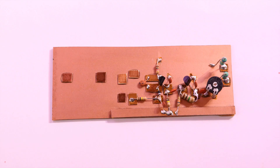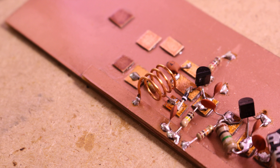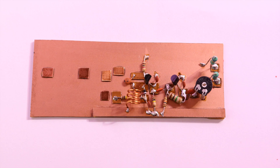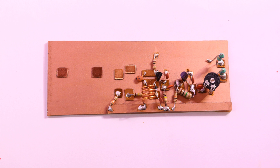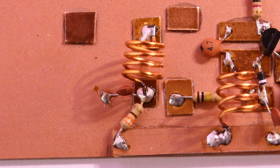From the varicap to the pad I added later I soldered a 100k ohm resistor. Next I added the coil from plus to the collector of the transistor. The coil is 8mm in diameter, 4 turns, and approximately 7mm long. The best way to make the coil is to use a screw with the right diameter and wrap the wire around it. After that I soldered a 330 ohm resistor from plus to the pad next to the varicap pad, and from there to the other pad another coil with the same dimensions as the first coil, and a 1nF capacitor to ground.